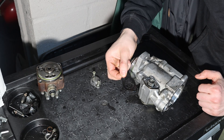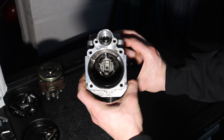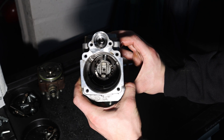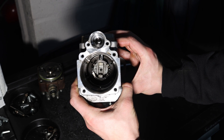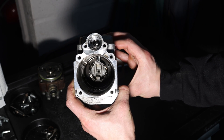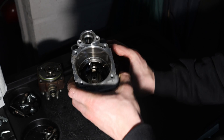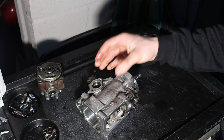This is actually a different seal than in my kit, which is stupid to say the least. And this is the advance mechanism — the solenoid at the top controls how much the cylinder at the bottom can move, and this causes the whole assembly to rotate in the interior, thereby retarding or advancing the injection timing.